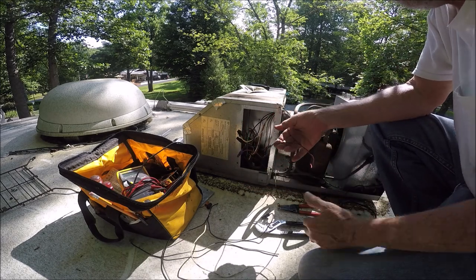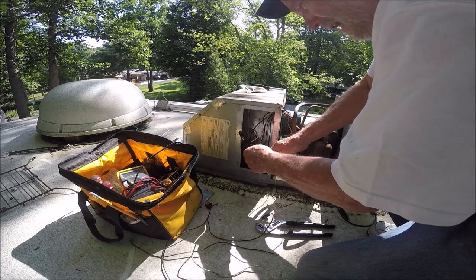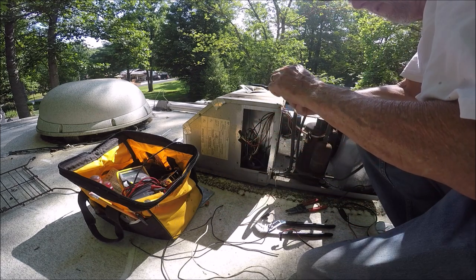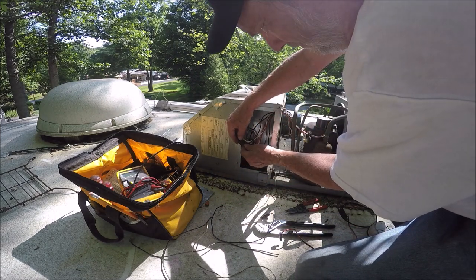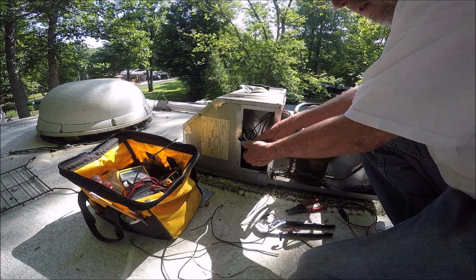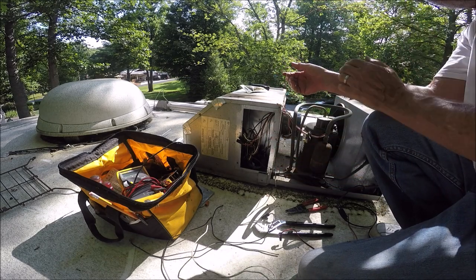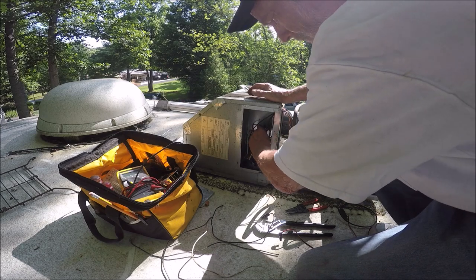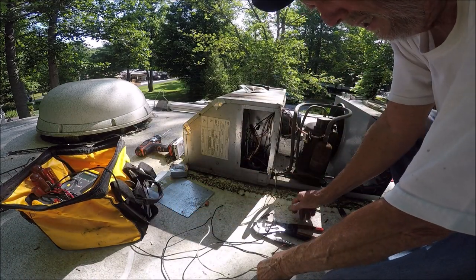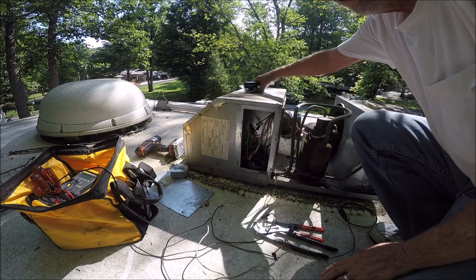Now the red one. See how easy this is — it's not hard, and I don't have to worry about getting electrocuted. I actually pull the plug out of the socket. Come close together, then twist them, and take your wire nut. You don't want any copper showing out of these because they're protecting you from shock. They're going to be in a compartment so they won't really be dangerous as long as they're in there. Then put everything back in, and before you button everything back up, do a test run — crank everything up before you seal it all up to be sure it works.